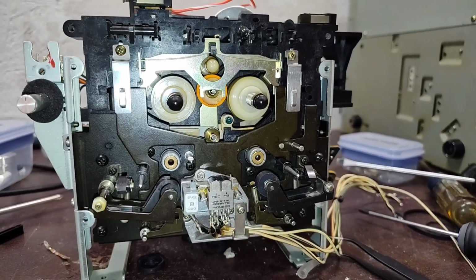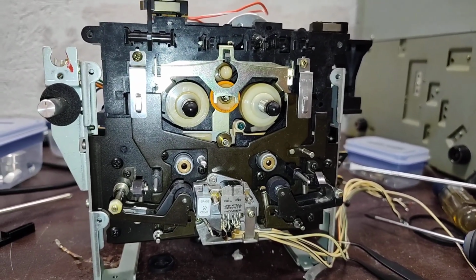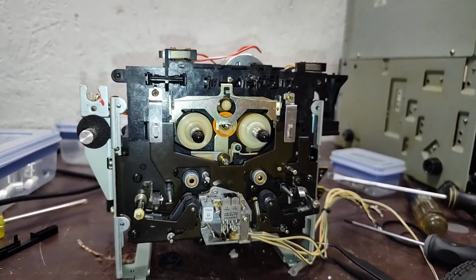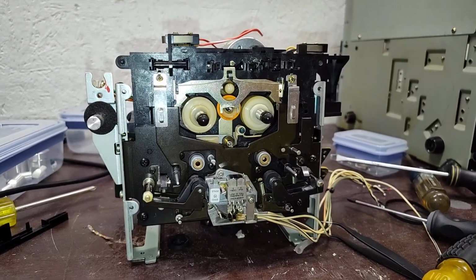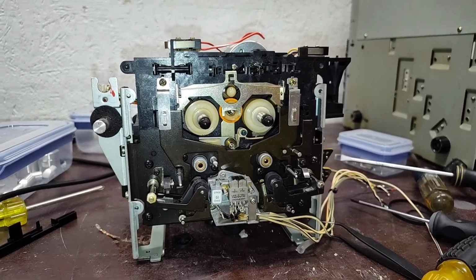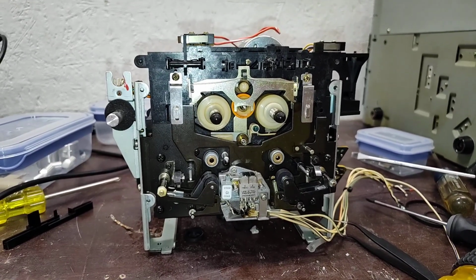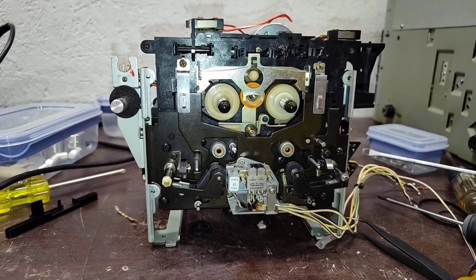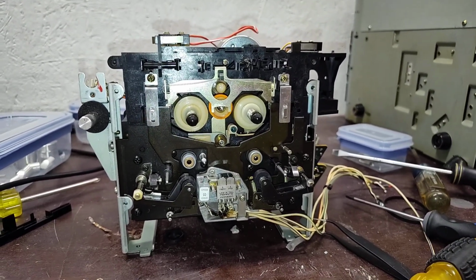We're going to oil up the capstans and reinsert them in here and start putting all this back together. And then in our next video, we can actually focus on powering it up, testing it, and see how well we did in dealing with things like speed and wow and flutter and tape wander and stuff like that. So let's get to putting the capstans back together, and then in the next video we'll do some final assembly, put it in the deck, and see how well it works.